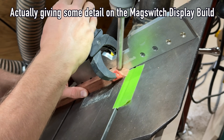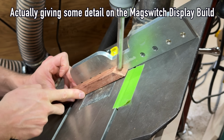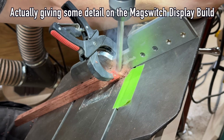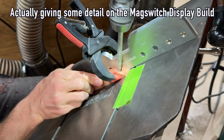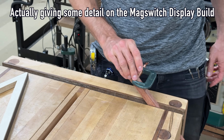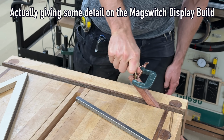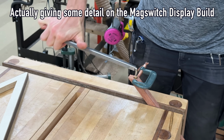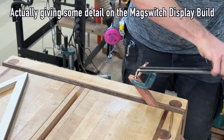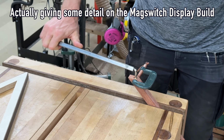These miters on the ends of 3/4 inch squared pieces of wood are going to get a threaded insert for 5/16 inch threads. This is really pushing it on size. The clamp that I have on here is absolutely necessary to keep it from splitting apart, but I proved it could be done. It worked on all of them, so I would call that about the limit, 3/4 of an inch, but can be done.